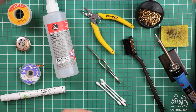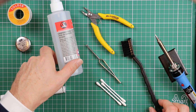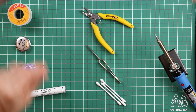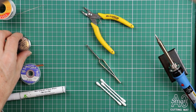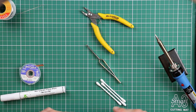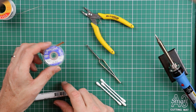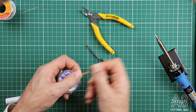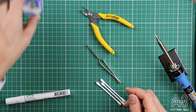So I'll move most of these things out of the way. You'll see me go off camera to the side here to regularly clean the tip of the soldering iron. As I've mentioned in the notes for the tools, I don't use a lot of isopropyl alcohol or my conductive brush. Solder — we're going to get through a lot of that. The tip refresher my soldering iron seems to be in good condition so I don't use that so often. You definitely want solder wick for the surface mount components if nothing else. It's almost impossible to get them soldered perfectly the first time and there's always a bit of excess solder to be removed, so the solder wick is vital.